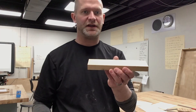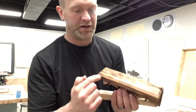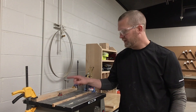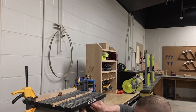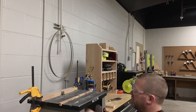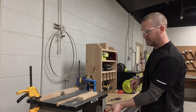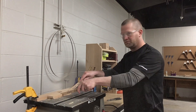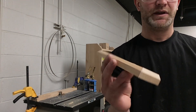The next step: I'm going to take one of these pieces of wood — this will make the top of this little shelf. All I need to do on this piece of wood is use the router and we're going to put a chamfered edge on this. Don't assume that there's already a chamfer bit in the routing table; you might have to change it. I got it all switched out, so I'm going to put an edge here, here, and here. This is the back side, and I just did the three sides — that's all we have to do to the top of the board.